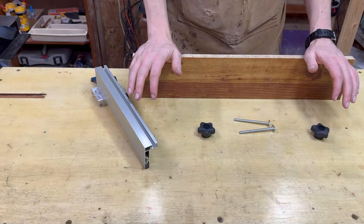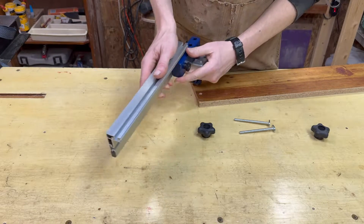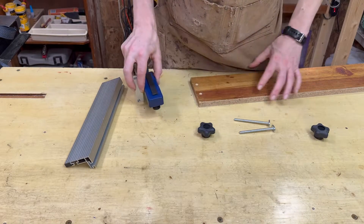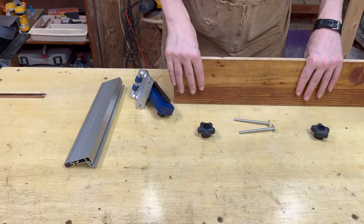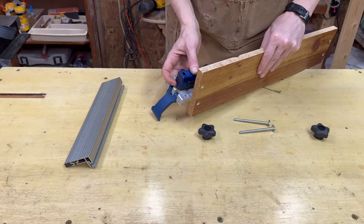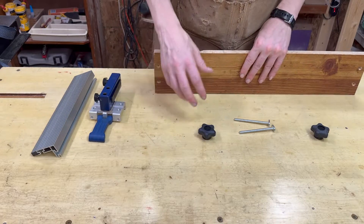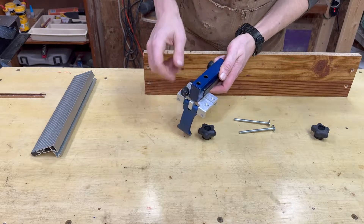The moment of inspiration came when I was cleaning up this fence and remembered that it just slides off and there's a metal brace along here that can go into T-track. If you want to buy some T-track, all you have to do is insert T-track into a straight piece of MDF — this is the back of an old cabinet — and you can literally just slide this on there and have it go back and forth. But for those of us who need to make a T-track system or some holes, we're going to use this bottom piece.